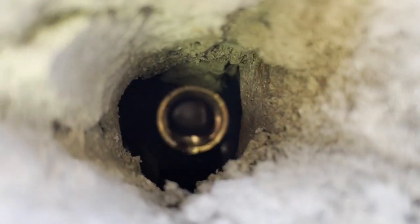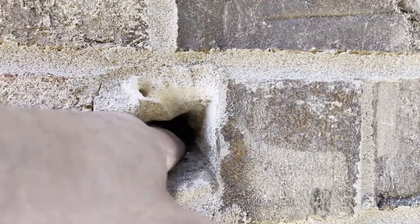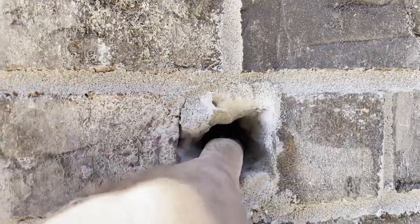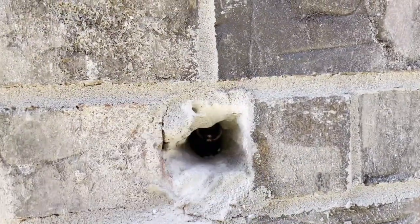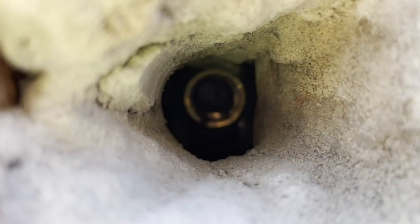Check that everything is fine with the connector inside the wall. Now you need to prepare the area and remove all the dust. Please never try to blow it inside because you will compromise the thread on the connector inside the wall and it will create problems when you go to install the new faucet. Looks clean to me now.